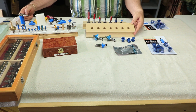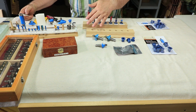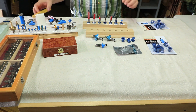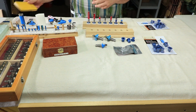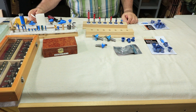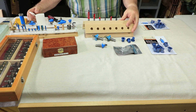Typically I'm using MDF. As with these two boards I've done recently, I put seven bits on each one. I made the boards 12 inches long, and to get even centers I divided 12 inches by eight to get seven centers — that comes out to one and a half inch centers for each bit. I use a construction calculator for fractional calculations like this. I also have the same calculator app on my smartphone for about an extra 15 bucks. If you want six holes, divide your length by seven — always divide by one more than the number of holes you need for even spacing.